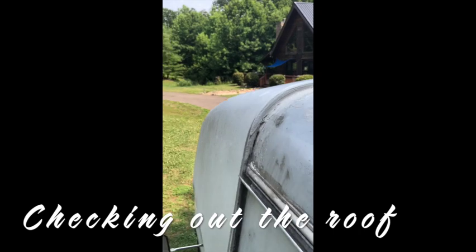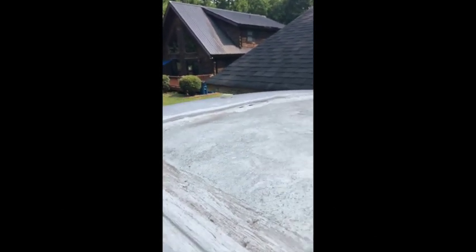I've got a tarp put over the top of it temporarily until I can get to the roof. I thought I'd come up and do a little inspection on the roof. This right here is one reason why I think I have roof leaks. There's another reason right there — there's cracks in that. And this is just not done well enough to where it would really be sealed. I need to basically strip down all this caulk, get all this caulk off of here, get it all completely washed, rinsed off, uncaulked, completely sanded down and cleaned up.